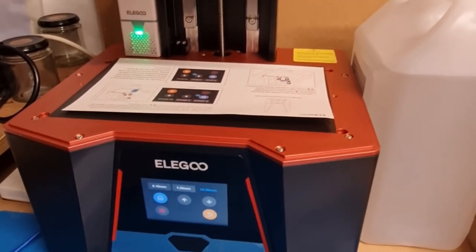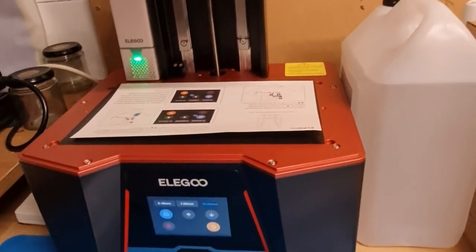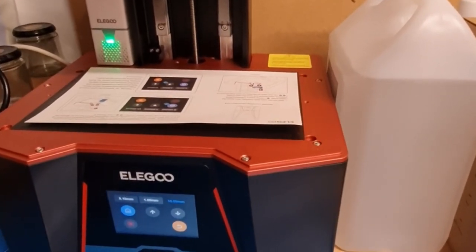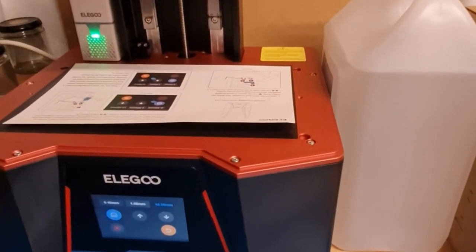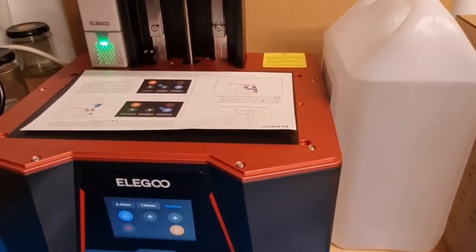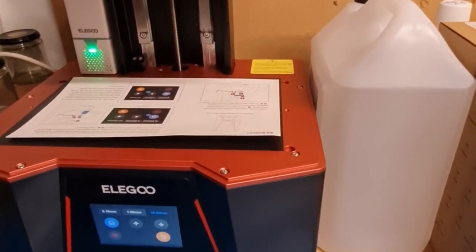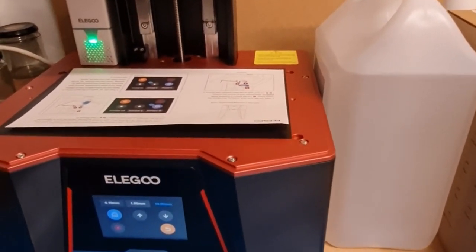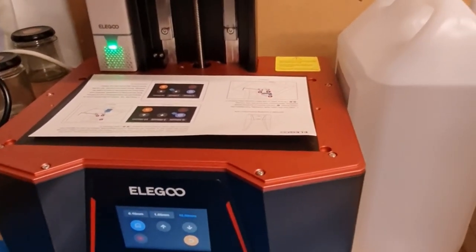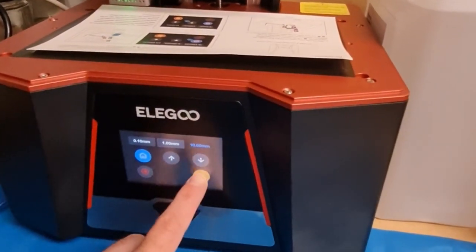So looking on the Elegoo site and looking at things, the card is not the best way to do it, but I want to show it first so I can review it, because the Elegoo leveling page says to do this first. And there's loads of people commenting going, please use an A4, can we update this, Elegoo, can you confirm? No one's really suggesting that from Elegoo officially that I can see. But so let's do leveling plate on the instructions.